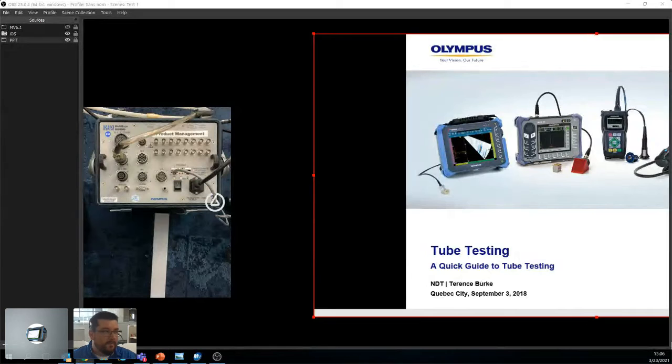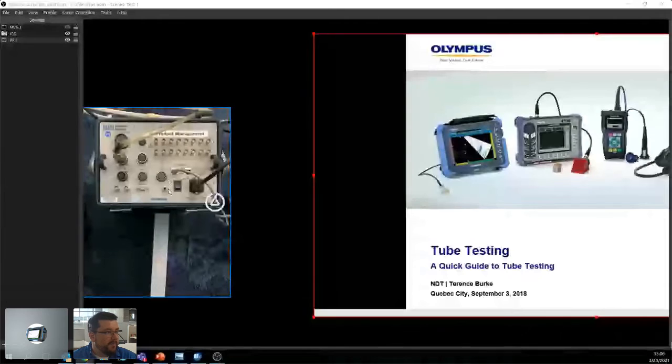So as I said before, we have 3 sections of this machine instrument. We have eddy current array. We have eddy current TEA, so regular eddy current, 4-pin Amphenol, standard in the industry. In the next column, we have RFT, which also takes over NFT. RFT is remote field and NFT is near field. Those are good for ferromagnetic applications. We'll see all this pretty much later. We have MFL, which is also very good for ferromagnetic materials, usually anything with fin fans. It's a good option.